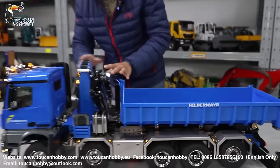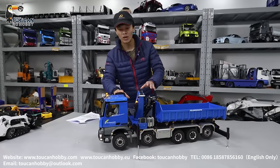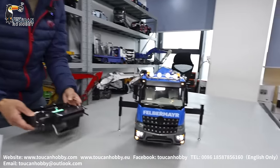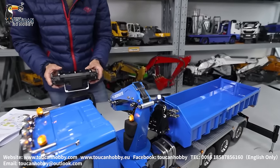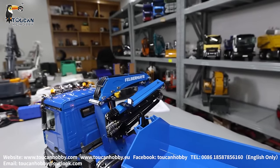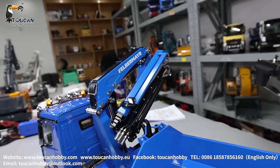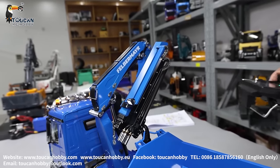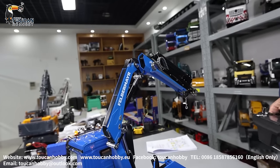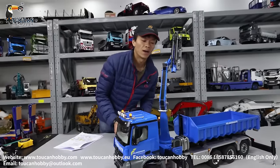In working mode, you cannot drive. Now you will see the operation for driving; it's now switching to operating the arm. First, big arm up, for safety. I already set it up, ready from the radio. Because in this mode, if you drive with the tires touching the ground, you damage the legs. Okay, middle arm rising. Let's first try to rise to the top angle.